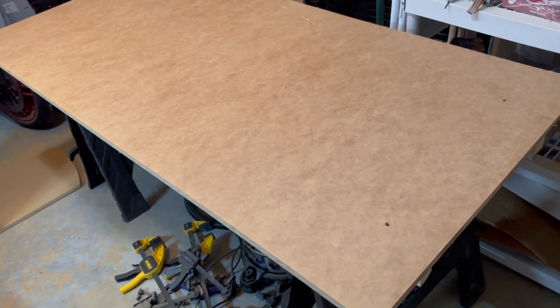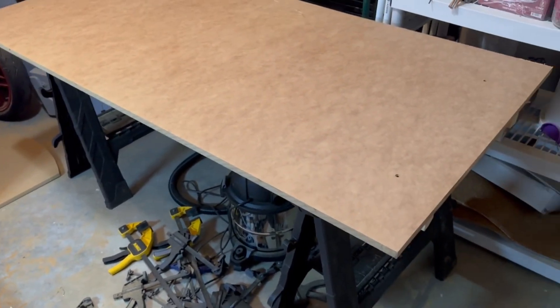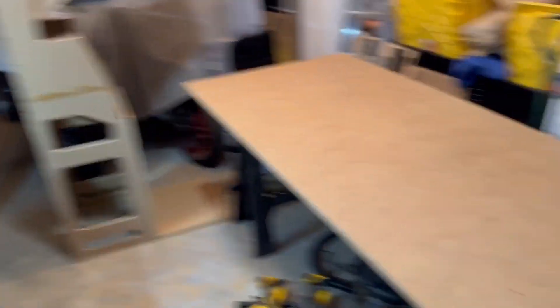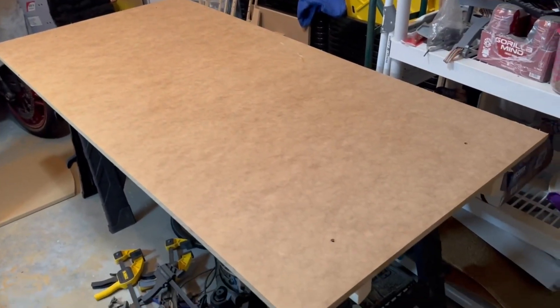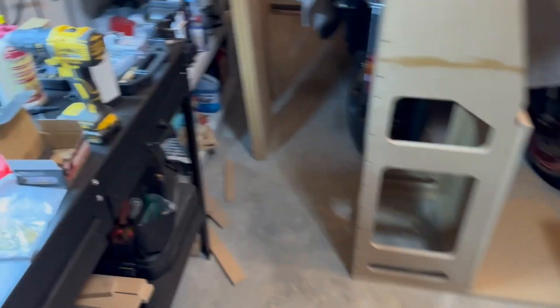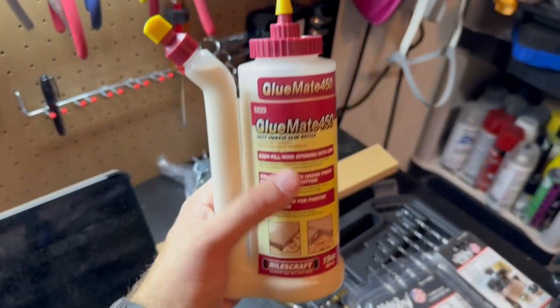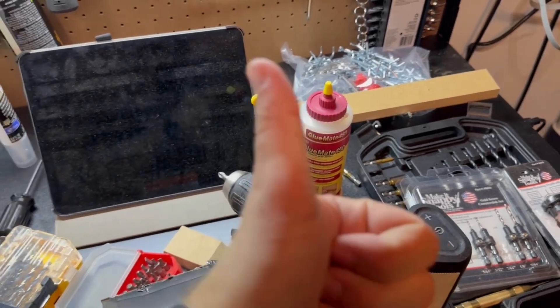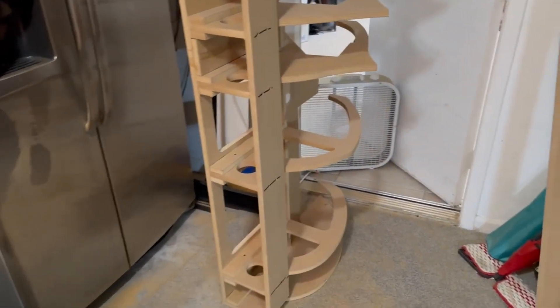Some housekeeping: the table was too big — I liked having all the build space but I cut some strips off because it was just too darn big. It's still more than big enough. Second, TJ initially told me to put countersunk holes and screw the workpiece down so it doesn't come loose. I didn't do it, had a couple close calls, and finally did it — took three seconds. Also, a big thank you to Chris Fisher of Invictus Cockpit Systems who recommended this five-dollar Amazon glue container — you pour your glue in and never worry about tipping it again.